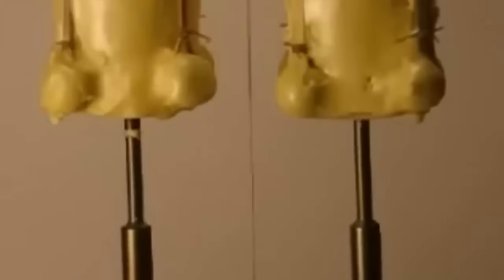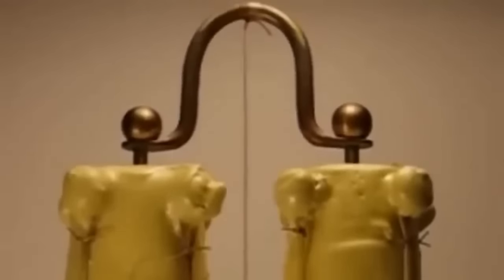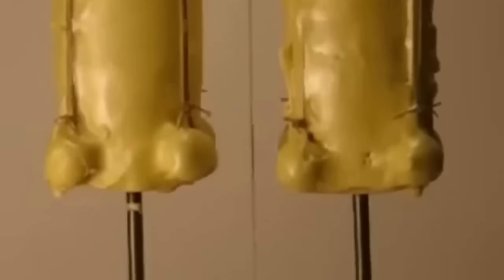Despite its perpetual ringing, the bell is nearly inaudible. The inner workings are clearly visible through the glass dome - it consists of a small metal clapper, likely brass, hanging suspended by a thin silk fibre between two vertical pillars which are dry piles linked in series. The clapper is pear-shaped because it's worn slightly on one side from striking the bell's edge. Between the bell's brass terminals at the base of the pillars, the voltage measures around two kilovolts and the clapper draws about one nanoamp while oscillating roughly at two hertz. The oscillations vary with weather conditions and slow down in humid weather, occasionally ceasing.